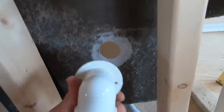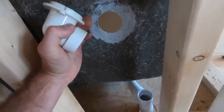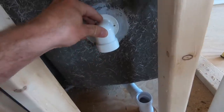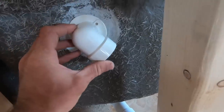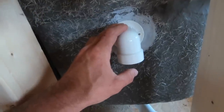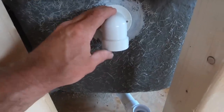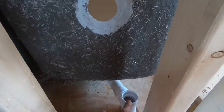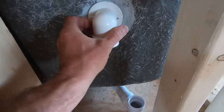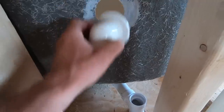The thing about this overflow is it has to be put on at an angle — this part kind of angles back. So this needs to be straight down. I always put them straight down when I have to do this, and then I use two 45-degree fittings — come down 45 and 45 into my sanitary tee, and it's pretty much that simple. We'll get this temporarily put in, get our measurements, and get this all ready to hook up if we're not leaking.